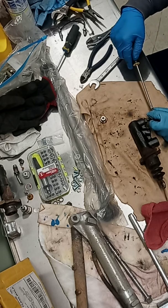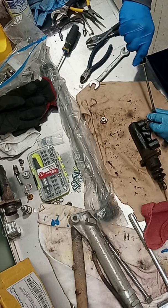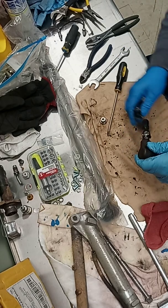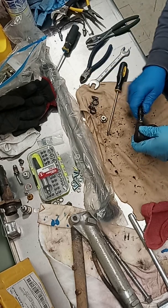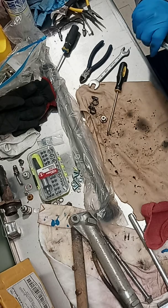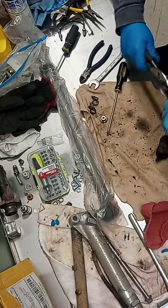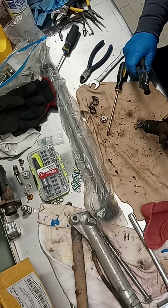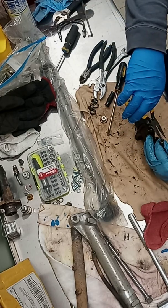This is the input line from the reservoir. Now inside this input line there's a screen that you don't want to lose — it keeps debris from falling down into your cylinder. If you look at the part numbers on Case's website, you'll see that it says the screen is no longer required. I guess they decided debris wasn't that big of a deal in there. Let's get that tube off and you'll see what I'm talking about.